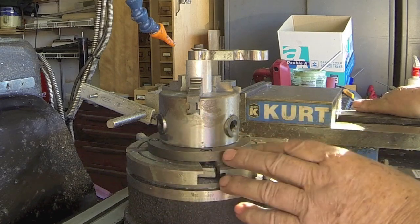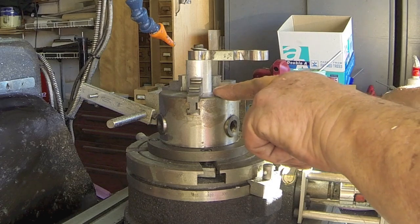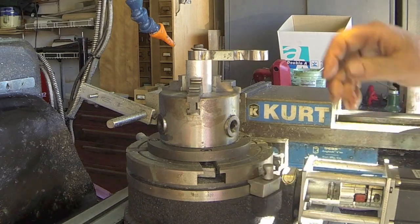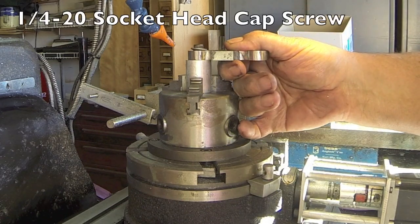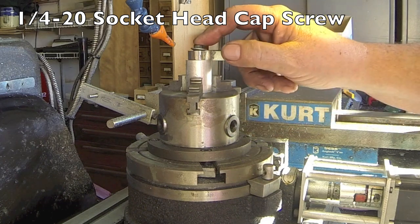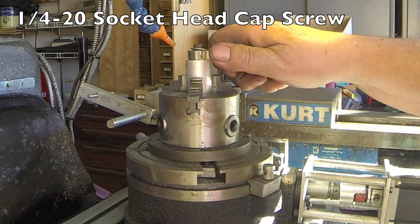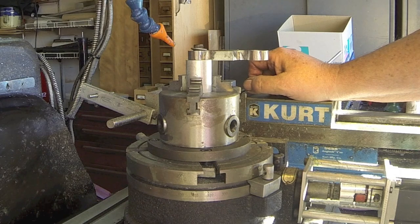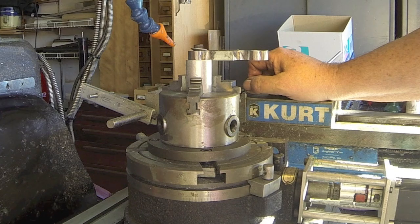What I've got is my rotary table, a little three-inch three-jaw chuck, and in that there's a piece of — I think that's one and a quarter 6061 aluminum — and I've got a hole drilled and tapped for a quarter-20, and this is a quarter-20 set screw and I've got it down tight and that seems to work. This other one took a half-inch 13 and I used a different little jig to do that. But what I'm going to do here is turn the mill on and crank in the right numbers and twist around a couple of times and show you what I'm doing.